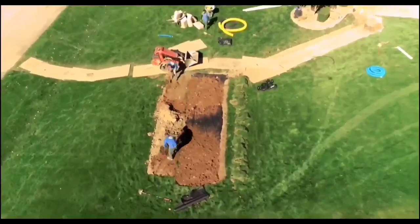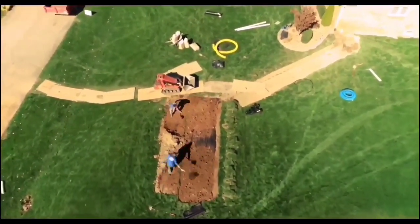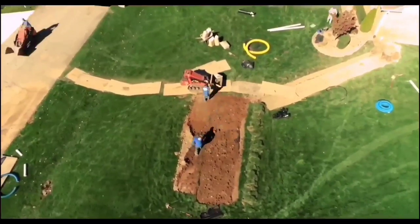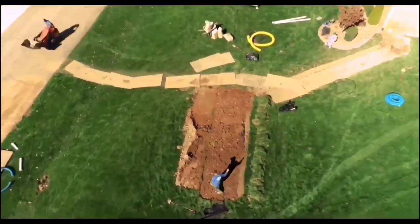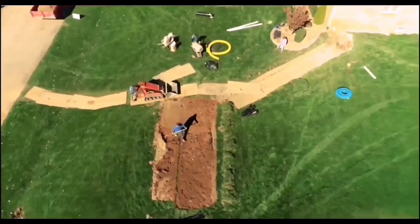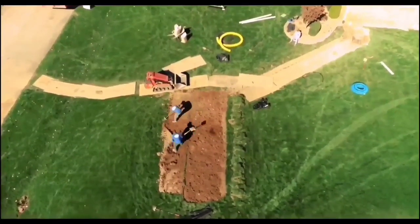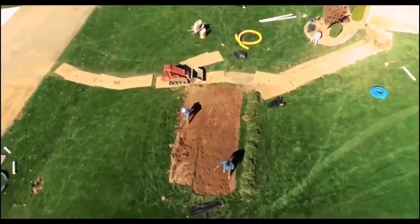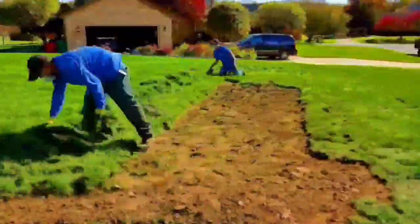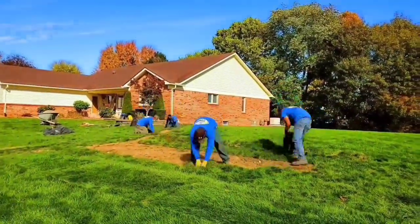So he can mow his ditch — it's not going to be a muddy mess. What the guys do is a giant burrito wrap. We have these huge six-inch chambers that hold all the water — the knife cut. And if you want to hold even more water, use big stone. For a leachfield trying to hold a lot of water, you can use two-inch stone — you've got big voids. Know this though: a leachfield is going to dry your yard out — you're going to be watering that lawn during the dry months wherever that leachfield is.